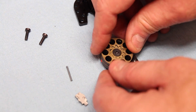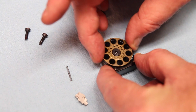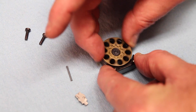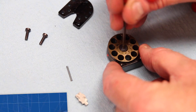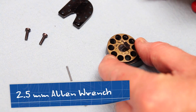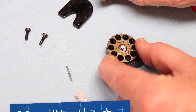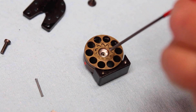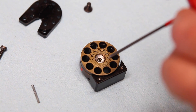The wheel is spring loaded, so there's tension on it — I can let go and it comes right back. That's why you want to make sure that whenever you put it back together you have that tension. This is a 2.5 millimeter Allen wrench that we're using on this set screw, and we'll go ahead and remove it. Be careful because inside this hole there's a spring and a ball detent.